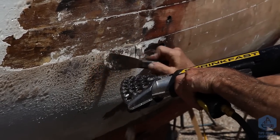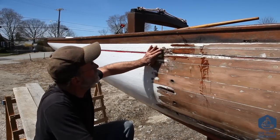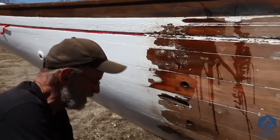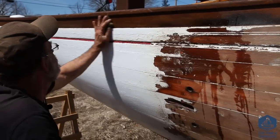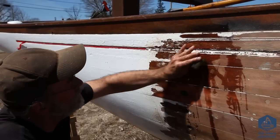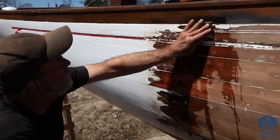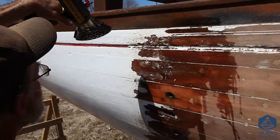What I have to do is wet the wood here — I'm just using salt water right out of the ocean — and I'm just gonna create a little wet barrier where I'm not trying to remove paint. I'm going to wet the bulwark a little bit, and it doesn't really matter if I burn that varnish a little bit because we're gonna plane that back. But now we get that nice and wet — it's like a protective barrier — and we're gonna pick up the heat shrink gun.